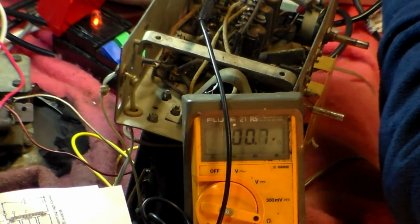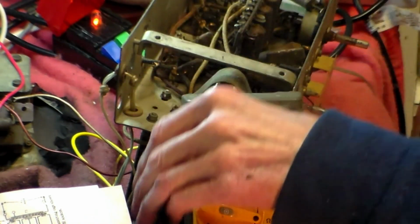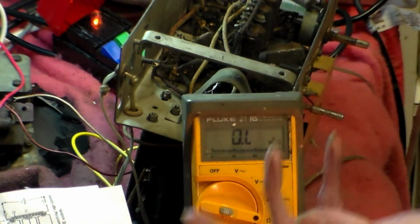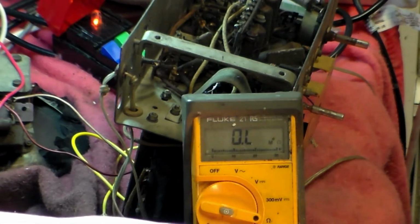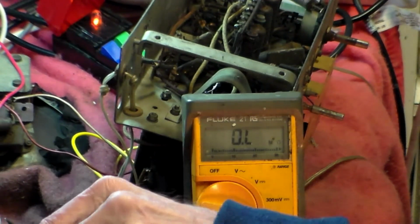Look at that. So that wire obviously goes to the cathode circuit. Now we know that the cathode circuit is working, otherwise we won't get anything from the radio, but we do. So I measured those two resistors and they are slightly out but not too bad, so that's okay. Therefore, that wire must be, if you look at the circuit,